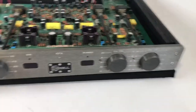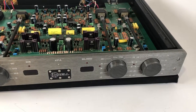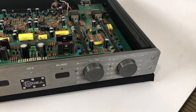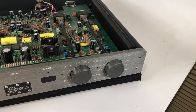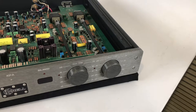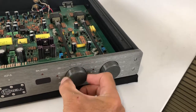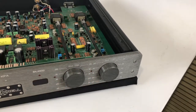Back to the controls — the balance would allow you to essentially use two of these KPAs as a single phono preamp, left channel and right channel. Moving over to the right, you've got RIAA trim. This affects the low end of the equalization curve so you can tweak the low end response of your cartridge to get what you like best. These LEDs would light up if you're off the neutral setting — neutral being at the top. As soon as you move to the right, the LEDs indicate you've gone off the main trim, plus to minus to the left and to the right.